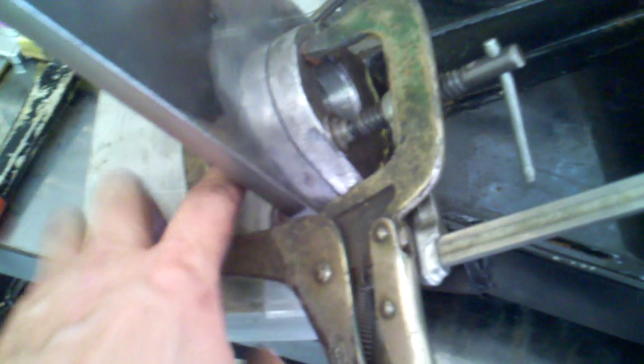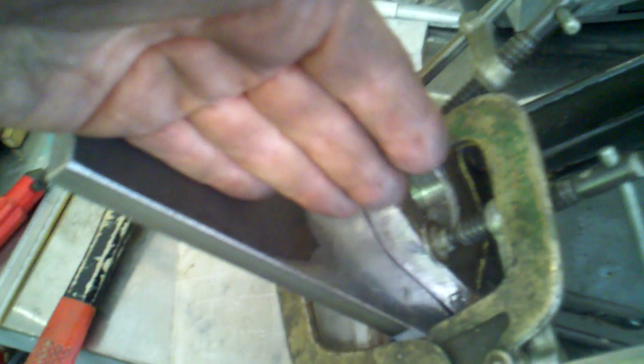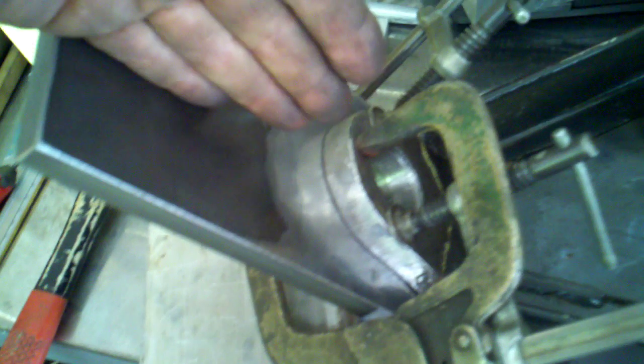I also had to use some 1-2-3 blocks to clamp it down to my bench right now for welding. This plate is machined square, so this piece is parallel here, and this is 90 degrees to that parallel — which means when I move this to my Y-axis on my Bridgeport, I won't be offset. It's just really tricky to indicate off of otherwise, so the square piece allows me to do that.